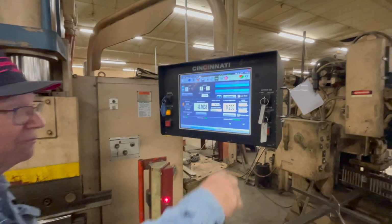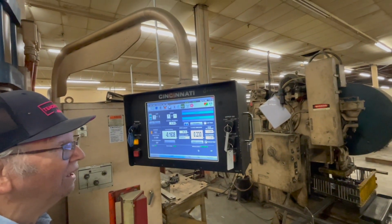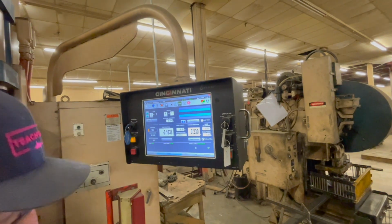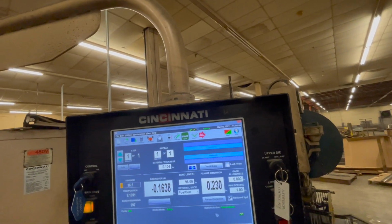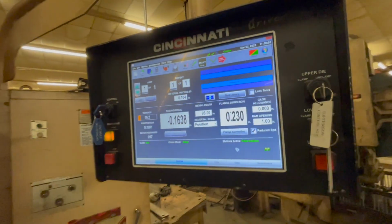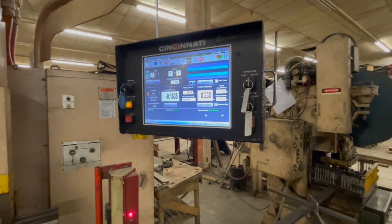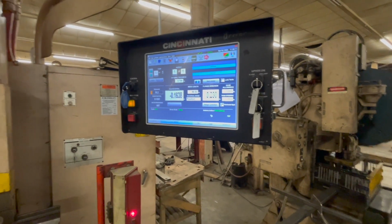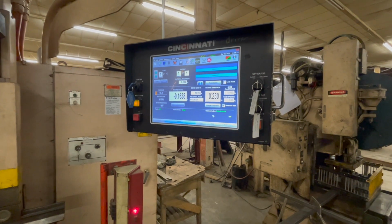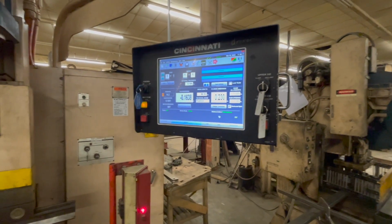Now we're just closing. Did it close? Yeah. You can't move it. Is there an icon on here that says it? Nope. Okay, not a biggie. So that's your die change. Basically, that's all you got to do to change dies. Then you got to go into setup, set the top of your stroke down and all that. I don't have to here because you use the same dies.